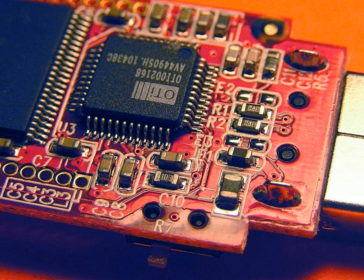SOT-143, 3 mm by 1.4 mm by 1.1 mm tapered body, 4 terminals, 1 larger pad denotes terminal 1. SOT-223, 6.7 mm times 3.7 mm times 1.8 mm body, 4 terminals, one of which is a large heat transfer pad. SOT-323, SC-70, 2 mm times 1.25 mm times 0.95 mm body, 3 terminals. SOT-416, SC-75, 1.6 mm times 0.8 mm times 0.8 mm body, 3 terminals.